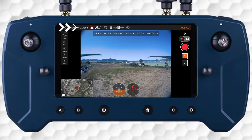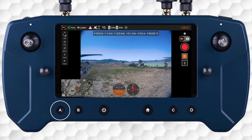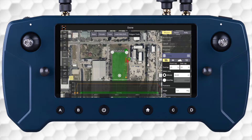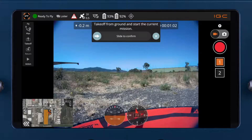This will put the aircraft into guided flight mode and will need to be returned to loiter mode or position hold by pressing the A or B buttons to regain pilot control. With the mission loaded, the on-screen slider will be shown automatically. If the slider is closed, it can be reopened using the actions menu on the left side. When the slider is confirmed, the aircraft will automatically take off, ascending to a specified altitude, then begin its programmed mission.